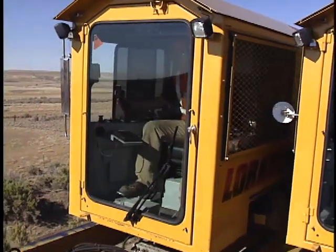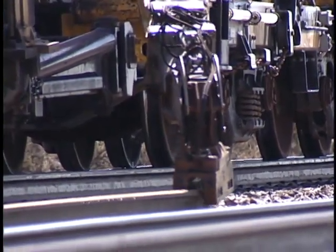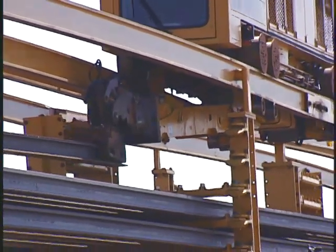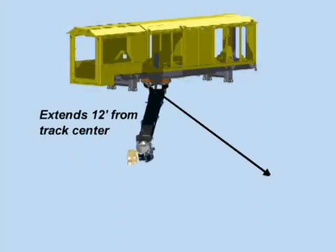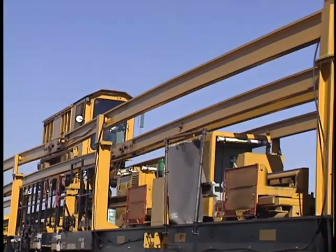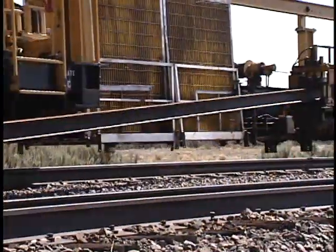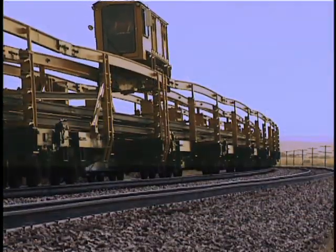Like existing North American systems, Raptor handles a variety of rail sizes. What makes it different is how it handles the rail. The cam-action rail gripper head creates the necessary tension to grab rail in almost any position, while other gantry systems can only handle rail standing straight up. To retrieve rails, the telescoping gantry arm extends up to 12 feet from track center and 4 feet below top of rail. The pinch rollers under the gantries create hydraulically generated traction to pull rails — not push them — eliminating the risk of rail buckling. Pulling up to 20,000 pounds, Raptor ensures quick and safe loading as well as gentle unloading of rail, even in curves.